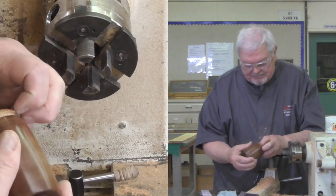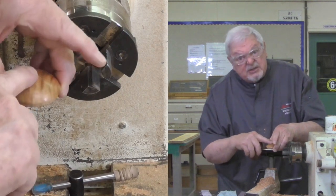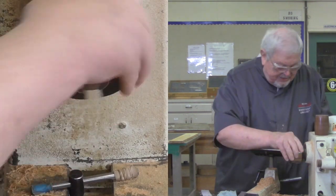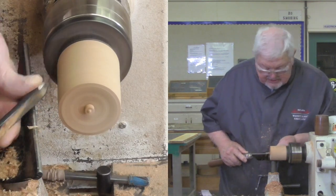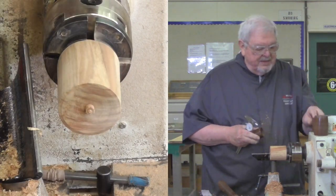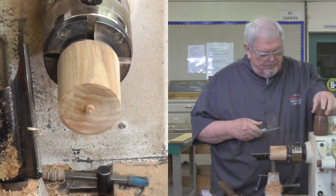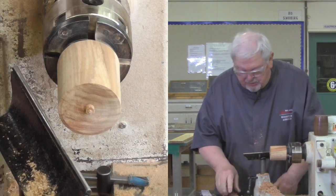Now, I'll need to keep this handy because box number 2 has to account for this height, the distance it sets down inside, plus the thickness of the next lid. So I've already accounted for that by cutting the length of the next box down so I can do that. So we'll make lid number 2 exactly the same way. Now, calipers, box number 2, inside diameter for the lid fit. There it is. Lock it. I'm going to clean the face up before I mark it.